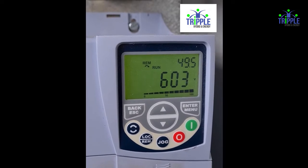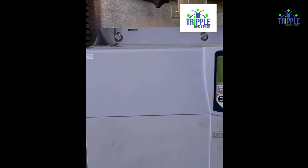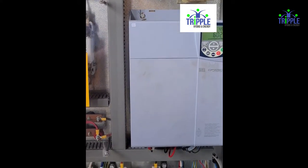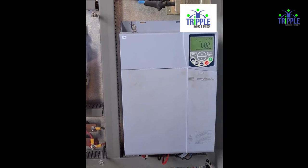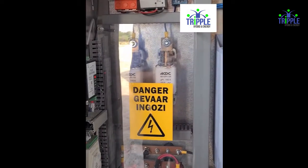When the setting on the big display shows volts more than 590 volts, it is pure PV. When it goes below 590 volts, the blending starts — it begins to put in some AC from either the generator or S1.